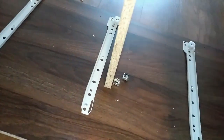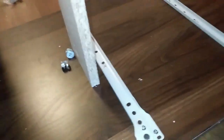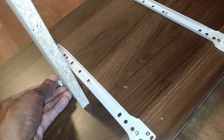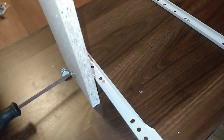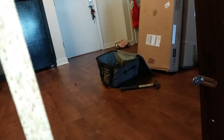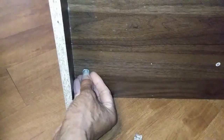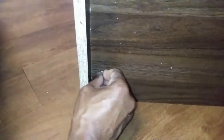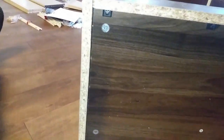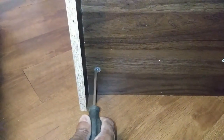As you assemble, you want to tighten everything step by step as you go along. That way you don't leave anything out or leave something undone. Clockwise to tighten. So now this is the bottom — I have it laying on its back so I can get to the bottom cam locks. I'm inserting and tightening the bottom of D right now, clockwise until the pointer points away from the bolt.